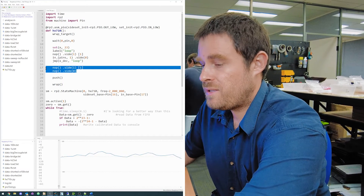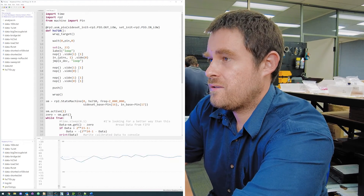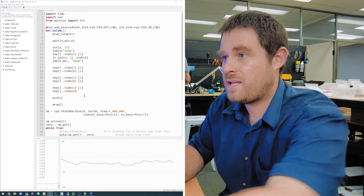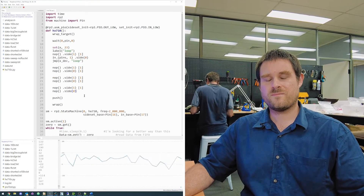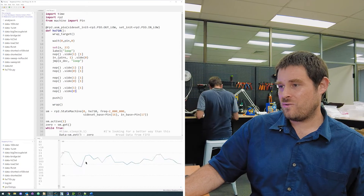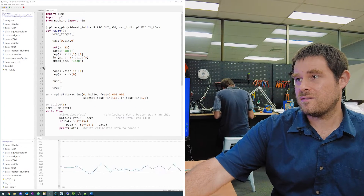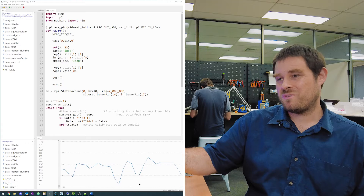If we copy those two lines of code, we would send additional clock cycles for a much faster sample rate. Copying again to get a third pulse gives us 40 hertz sampling. What's the trade-off — is 40 hertz noisier? When outputting data at 40 hertz we get significantly more noise, varying by about 250 counts in amplitude. Going back to 10 hertz, that 250 peak-to-peak noise reduces to about 100 to 200.